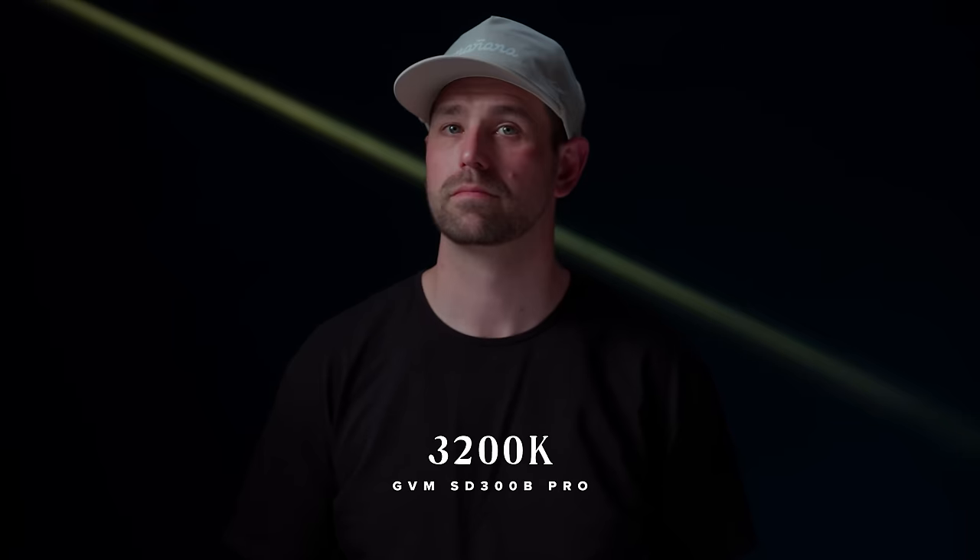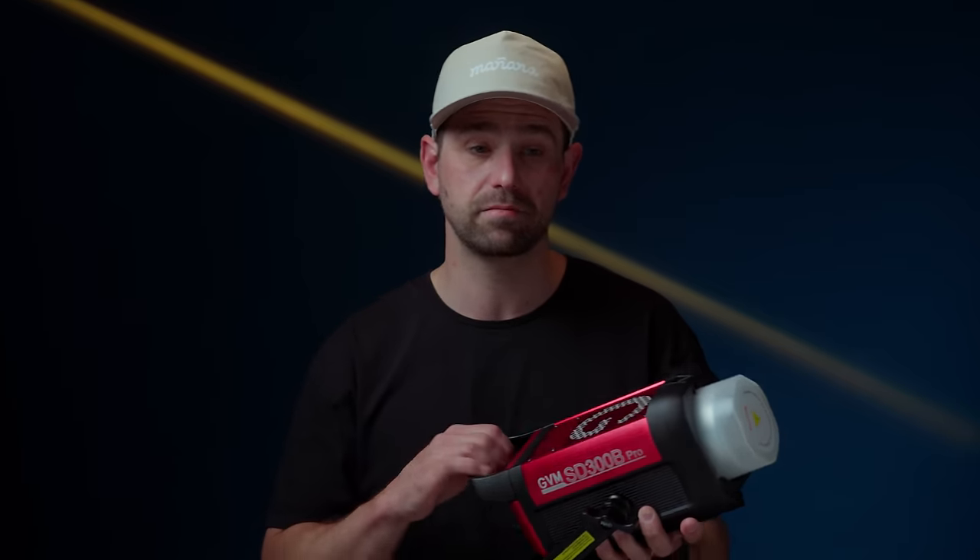Second positive is a very versatile color temperature range. It really provides the flexibility you need to get the proper color temperature for the environment you're in. If you're shooting outside and need to dial in up to 5600 Kelvin, you can. If it's cloudy and you need to go down to 4300 or 4500 Kelvin, you can do that too. And if your interior overhead lights are 2700 Kelvin, you can set this up and match that color. So that's awesome.